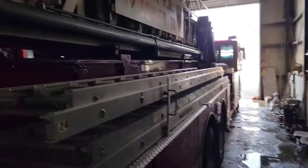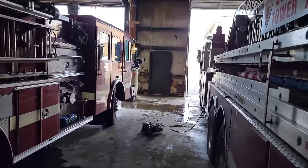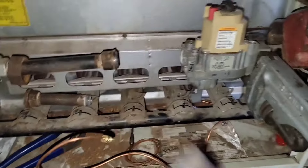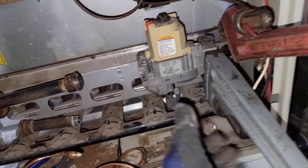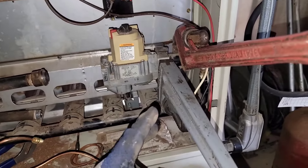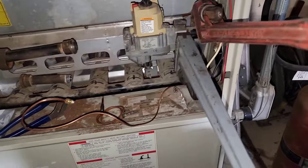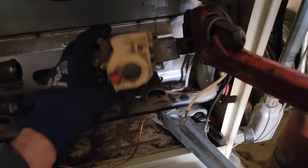I'm using a couple of pipe wrenches and then of course some pipe thread sealant and Allen tools. We're actually in the fire hall, so pretty exciting — got to get them some heat. So got this little connection here loose, this half inch nipple and part of the union. You want to make sure that you have two pipe wrenches, otherwise you could end up bending something and that's unnecessary. So just want to give you that tip. Now that it's loose, I'm glad we've got enough room to actually take it out.